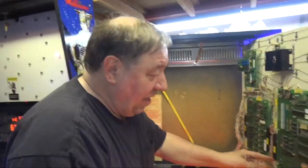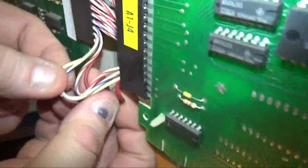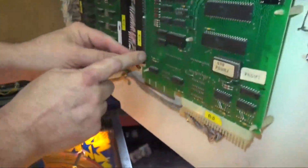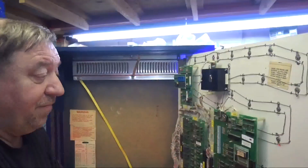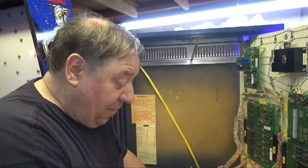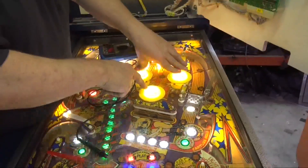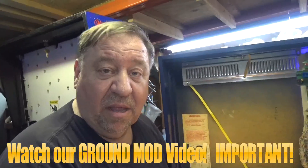We're 5.03, which is fine. See how easy. Obviously if you're doing a Gottlieb, always put your second jumper in down here — so this is our red wire here, that's our second jumper. That'll ensure a good ground between the logic and the driver board and sound board and caps. That's all you have to reflow in this game. All their pop bumper boards have the same header pins by the way, so in a Gottlieb game you have to do the pop bumper boards, and then of course you have to do the ground mod on the bottom — that's in another video.